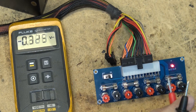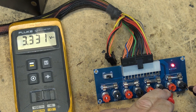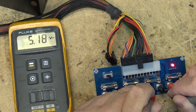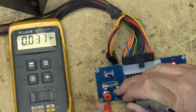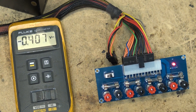Power on — that's a little better. Help if I put the leads in the right polarity! 3.3 volts — dead on. 5.1 volts — dead on. 12.3 volts — close enough. Minus 11.1 — close enough.